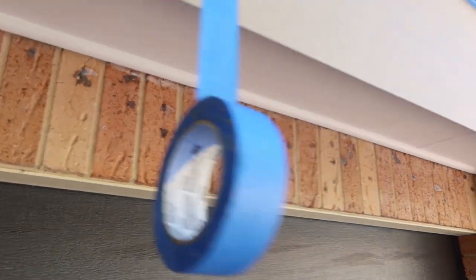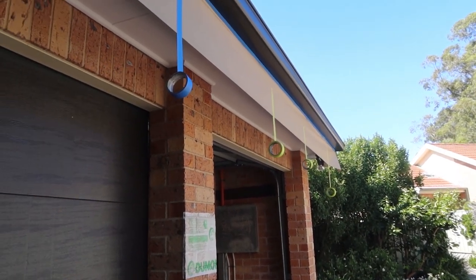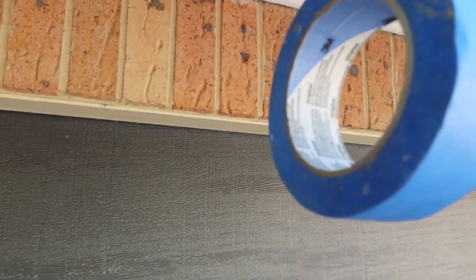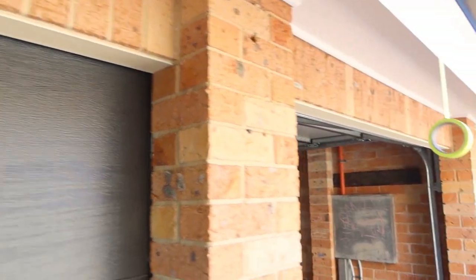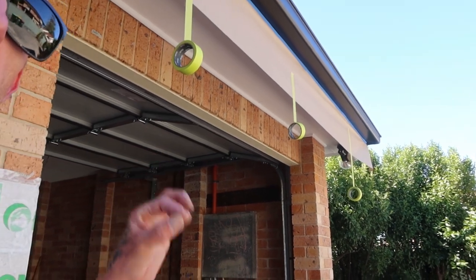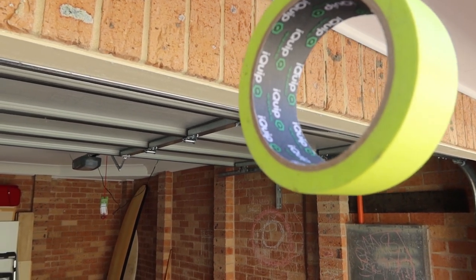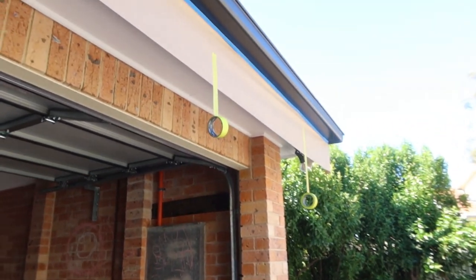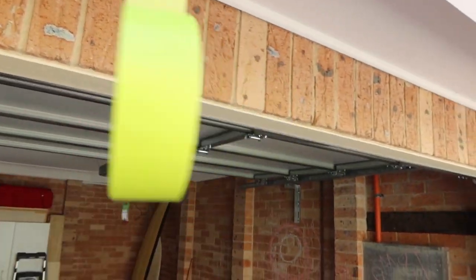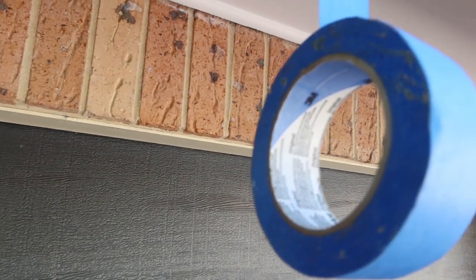Anything that I don't want to stick, or if I've just gone through and sprayed out all the fascia boards and I want to get them taped up within an hour after spraying, I'll use the 3M Scotch Blue. It doesn't stick to anything - this is awesome tape for taping up something you've just painted or when you need really low tack. My all-rounder is the iQuip Envo Tape for anything other than brickwork or render. It has a medium to high tack, so it's awesome tape. I find I use this more than anything else. But when it comes to render or anything like that, it's the Tenacious. And if I want tape that doesn't really stick or is going to pull off existing coatings, I'll use the 3M.